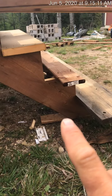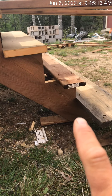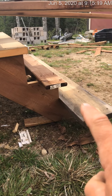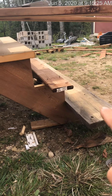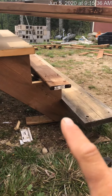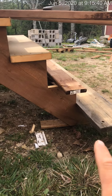You have to remember on the bottom when you're doing this — you have to cut an inch and a half off the bottom, because your tread is an inch and a half thick. If you don't cut it off the bottom, it's going to raise the bottom step an inch and a half higher than what the top step is, so the spacing from the bottom to your deck won't be right. We can't forget to cut that off when we're done. That's your basic stair stringer.